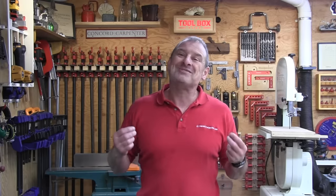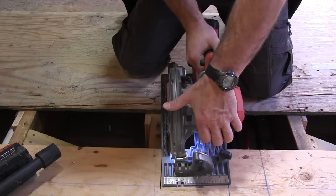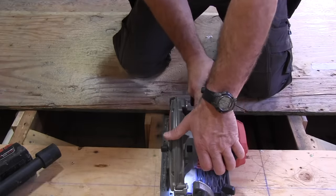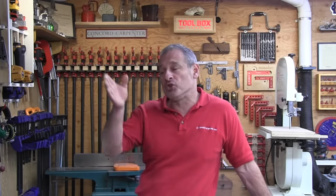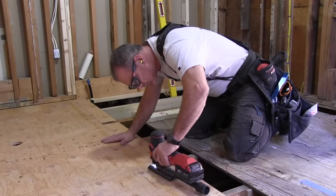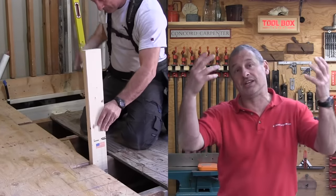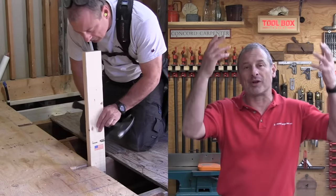So, what is the best way to reinforce or build a strong half wall? Well, reinforcing a half wall can be accomplished easily if the floor joists run perpendicular to the half wall. In this instance, all you do is simply run your half wall studs straight down alongside the joists and attach them to the floor framing — super secure and solid. This method requires that the subfloor is open from the top so you can work below, or the ceiling is open from below so you can work above.